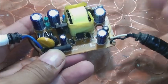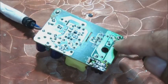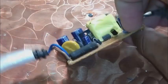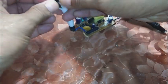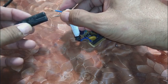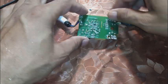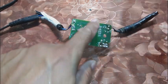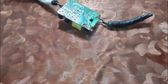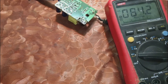The proper way is to switch this on and then measure the voltages with my multimeter — I have to check the DC voltage over here. For the input, here are the two cables we will connect to the mains. My mains — I will connect this over here. At the moment it is not connected, so I can touch it, but later once connected to the line I will not touch the hot side. So now I am going to connect it to the mains. It is connected. Let me check the DC voltage — I am selecting my multimeter to DC voltage.